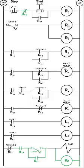So we know we're picturing the solenoid. It's on its way back. It just left here. That just went back to its normal state and closed and recorded the 1 count. It's still on its way home. When it gets home, this becomes closed. When that closes, that energizes, which is going to make the cylinder start to extend again. When the cylinder starts to extend, immediately that's going to become open, but we got it covered because we got our holding circuit.